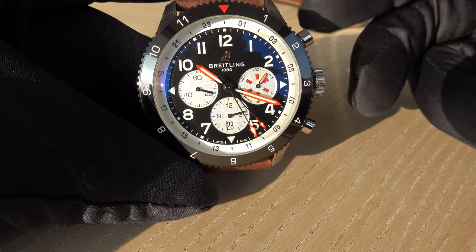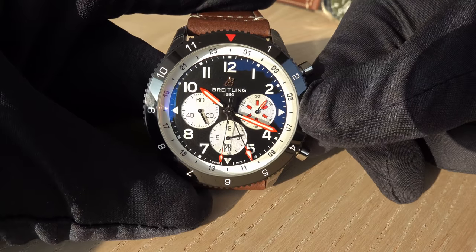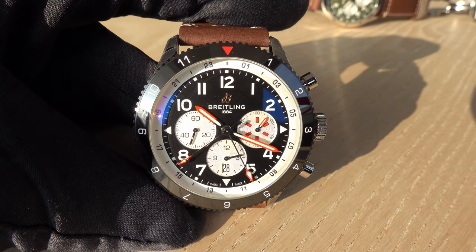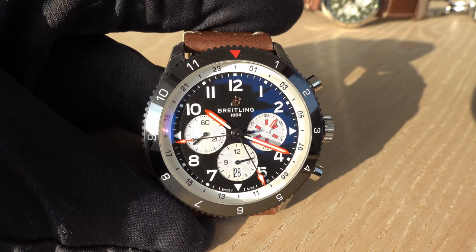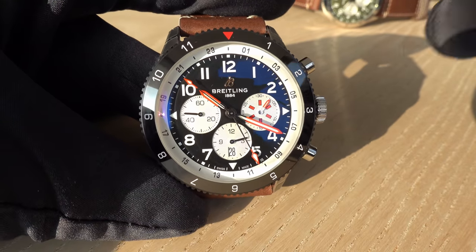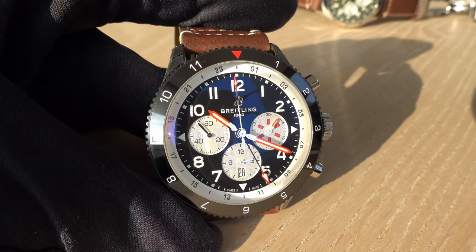This is something Breitling can't change because there are still patents on silicon hairsprings. The last patents run until the year 2023. They are covering or protecting the development of a silicon hairspring. So until then, Breitling, like many other brands such as all the Richemont brands, is not able to implement any silicon hairsprings in its watches. If you take this movement, the B01, or its modification as a B04 with the second time zone indication, Tudor uses the same movement, and Tudor uses a silicon hairspring in the movement.